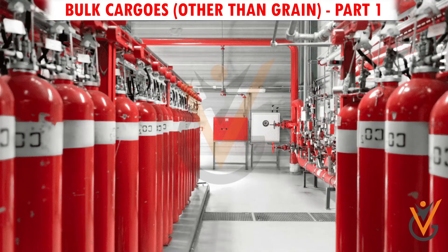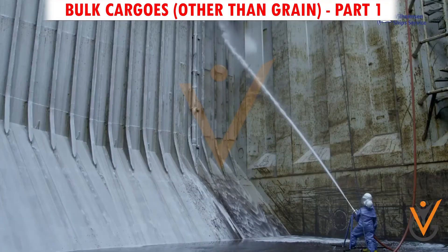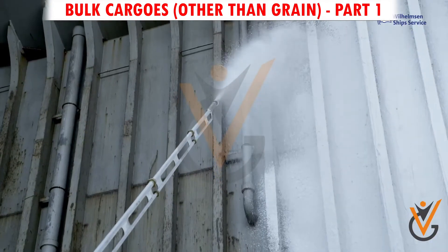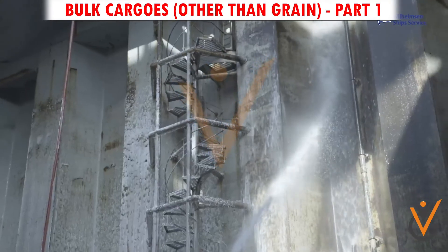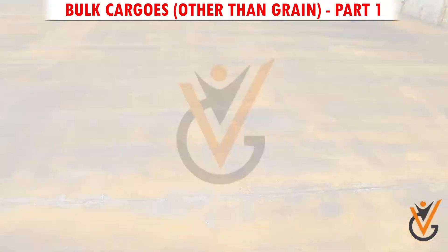Step 5 – Testing of CO2 system: It is to be tried out. Step 6 – Lime wash: This is applied to the lower areas of the ship side, bulkheads, the full tank top, and hold bilges when salt cargo is to be loaded in bulk.